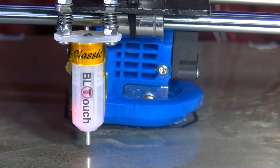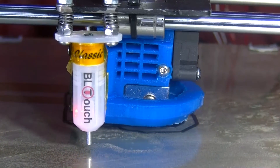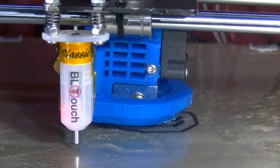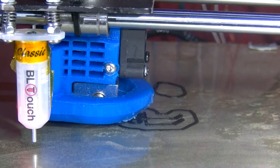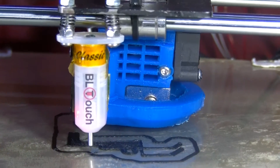I have retraction set to 4mm. That's quite a lot on the E3D version 6 — mine's a clone here. And all I've changed is to tighten this nozzle up a bit.